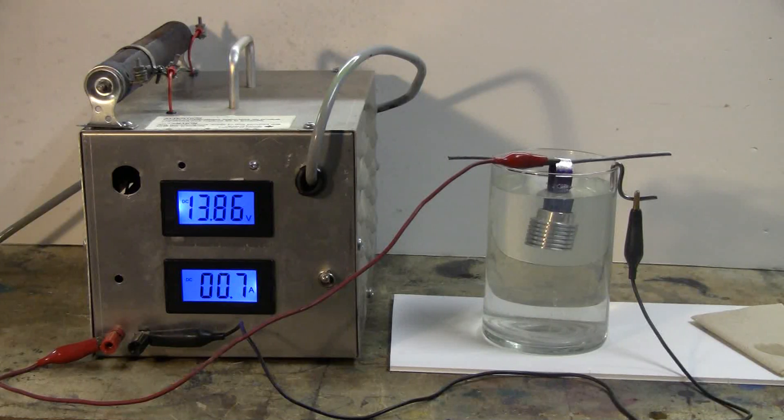The part's been cleaned and degreased, and it's been placed in the anodizing bath and is starting to anodize. The power supply I used in the first video has simply been built into an aluminum box and given a digital panel meter pair — one for voltage and one for current. So we'll pick this up when the part's been anodized and we're ready to show the dyeing process.